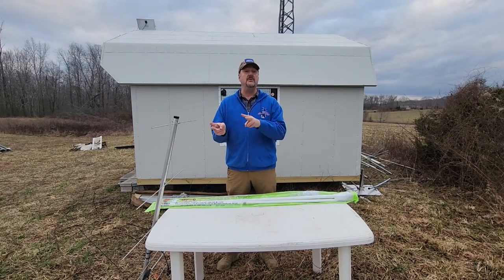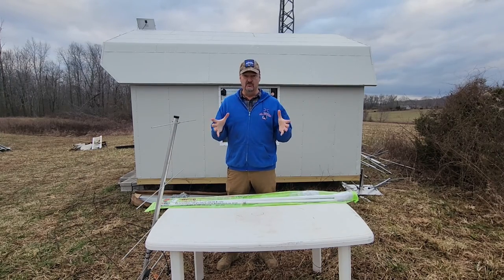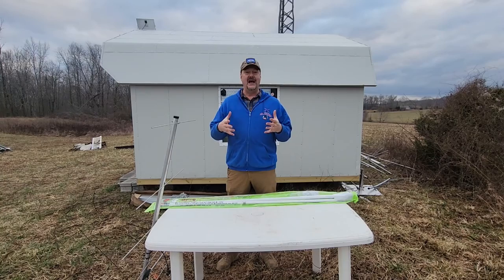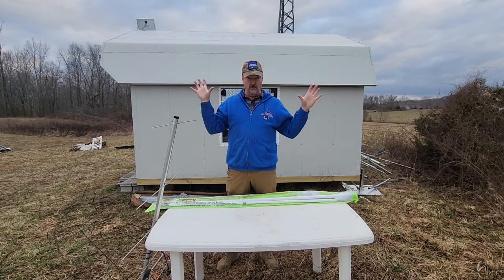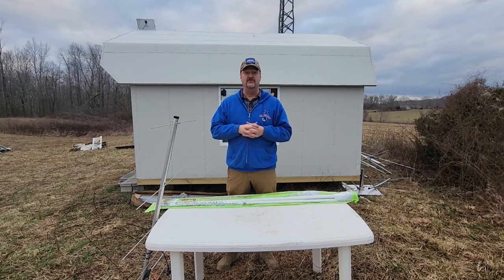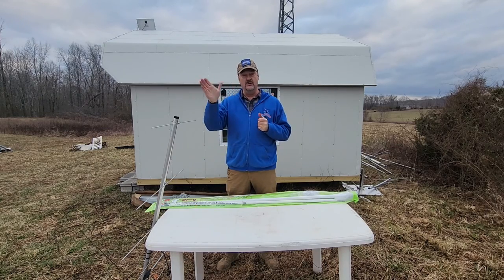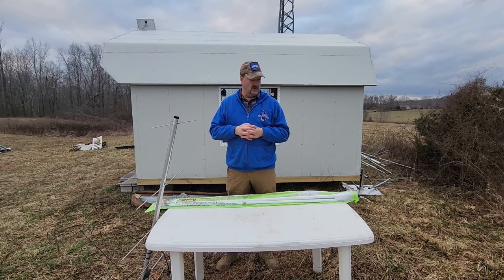Now, I've used both of the other two for remotes and at my old QTH, but here at Tiny Fangorn, I am very rural, meaning that I don't even have a lot of local repeaters in my area, but there are a few further away. The GP6 has a little bit more gain. It's going to be pretty high up there for things around here, and I'm hoping that not only can I hit the one repeater in the county that I live in, but another repeater that's in the county a little bit north and east, and possibly some repeaters going south down towards I-40.